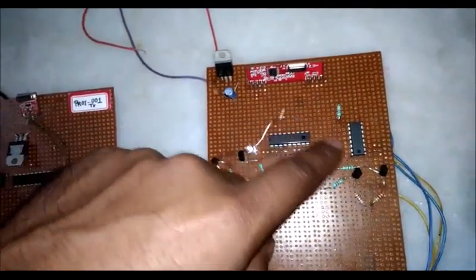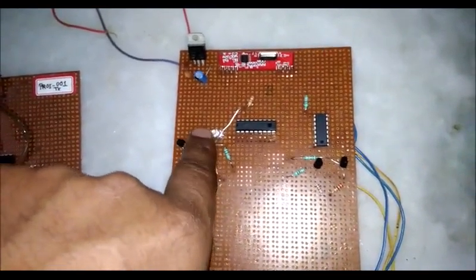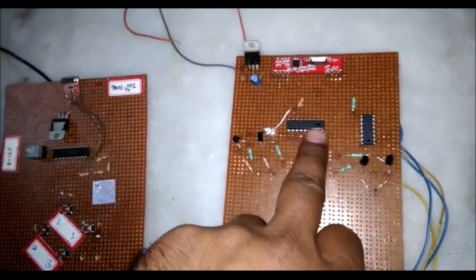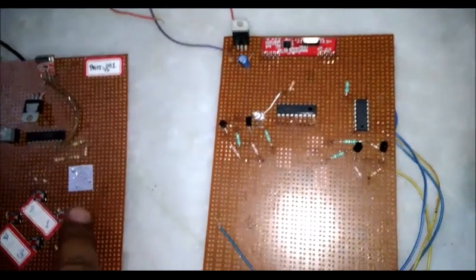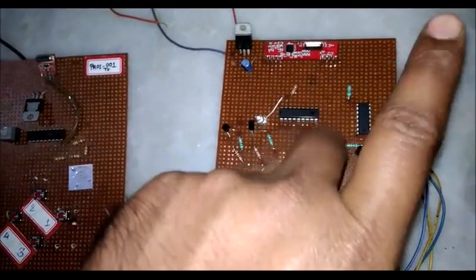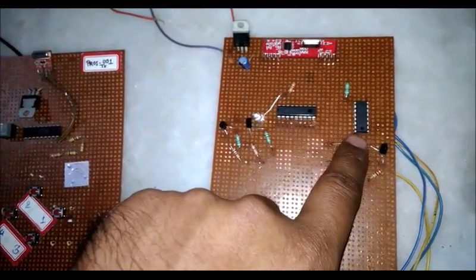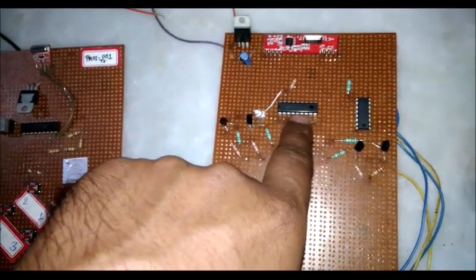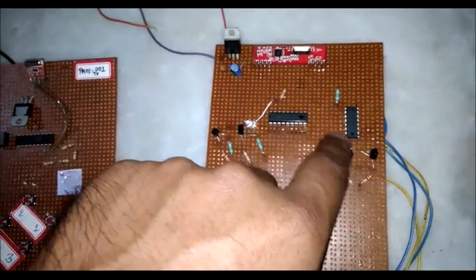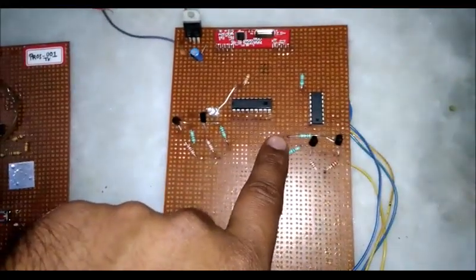Okay, so actually here I have also used BC547 transistors. But you may be thinking, why have I used them? Actually, in this module there is a problem: when a signal comes from this side to this side, it comes as 1. Means if you don't give any input at the pins, the module always shows the decoder pins as signal 1. Means the pins are in the high state. But suppose I have connected a motor with that, I don't want the motor to run all the time. So I need to invert the logic. That's why I have created this inverter by using the BC547. You can also find the link of the inverter circuit in the description below.